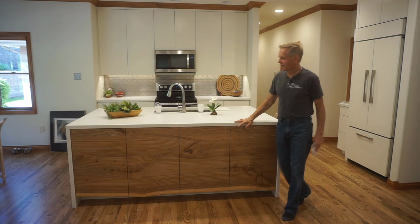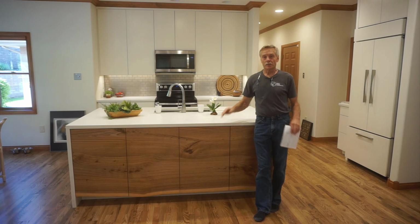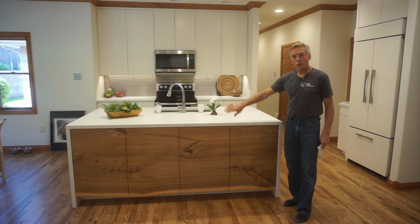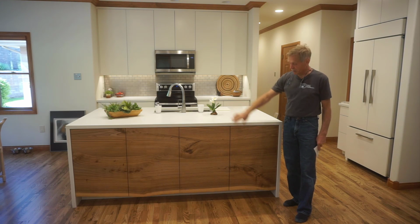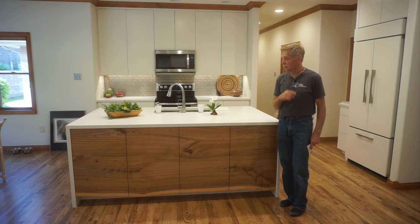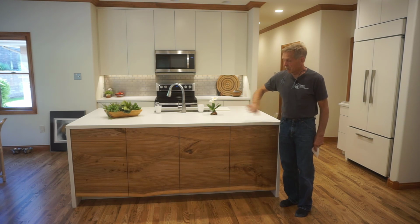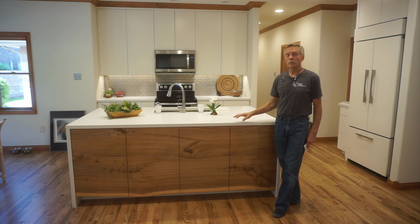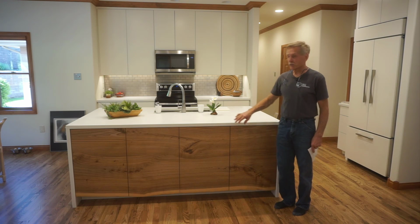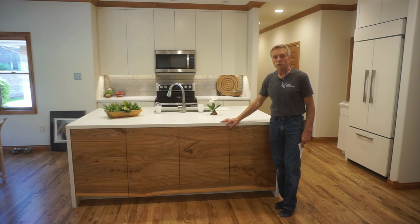Well, hi guys. I've returned to my client's home so that you can see what 2 large elm slabs joined with a live edge joint look like when cut into 4 cabinet doors, live edge cabinet doors for this waterfall island cabinet. After the thickness sanding process that you just saw, which took these doors up to 220 grit, I finished this by going over it with 320 and then a couple generous coats of gel polyurethane to get a permanent durable finish that'll protect these wide pieces of solid wood from twisting and warping over time.